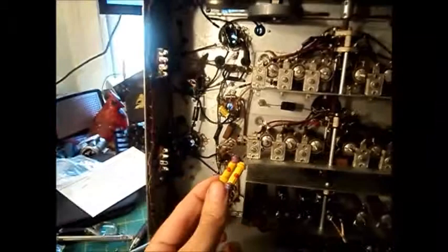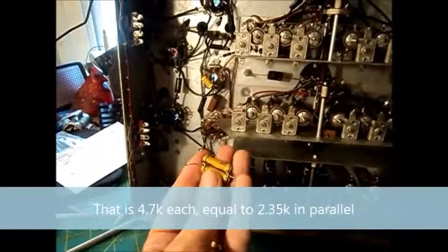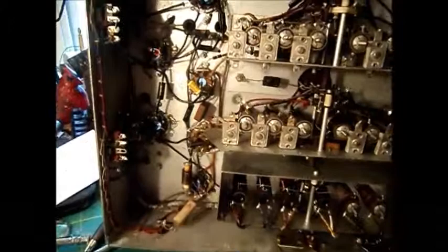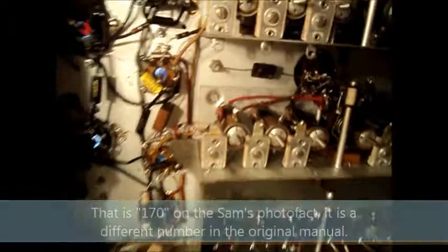This is Tom. Well, we finished the recapping. You'll notice one glaring yellow cap — I came up short one. Luckily I had a yellow one. And this resistor was the dog bones. What I discovered is they are equal to 4.7K. Since they're in parallel, you half it — they are 2.35K. They ohmed out to 2.5K. Resistor number 170 in the schematic calls for a 2200-ohm. So this is a 2.2K that I put in. I replaced it — it looked neater. I will eventually get a black one to match the rest when I order from Just Radios.